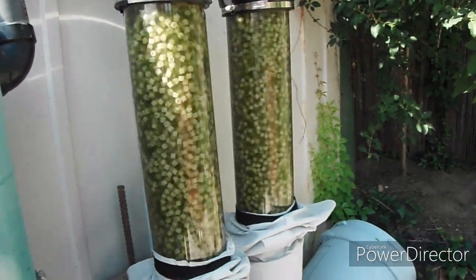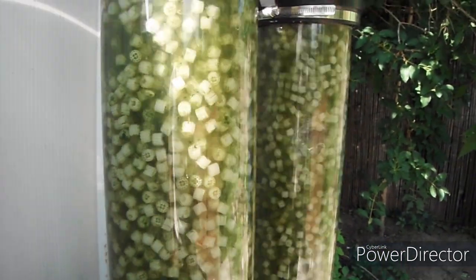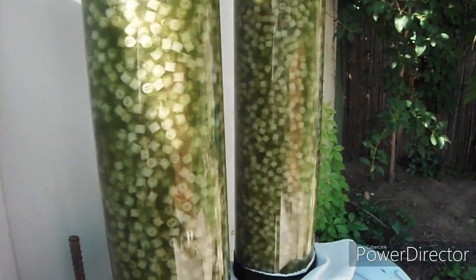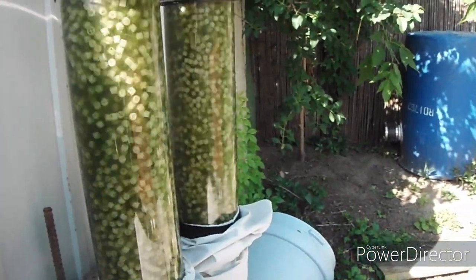The upflow pump has now been turned off and it's boiling in here, as you can see. If you take a close look, you can see the condition of the water that is inside — both of these just indicating how much debris these filters are collecting. So I'm going to let those boil for 20 minutes or so, and then we'll get back and do a dump of the water. I'm going to collect some of the water as I release it and we'll show you what it looks like coming out of there.